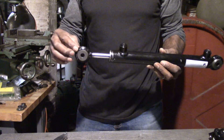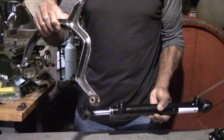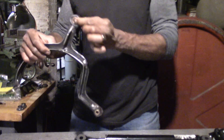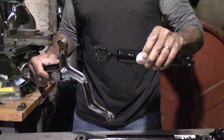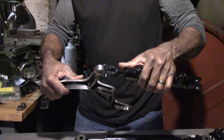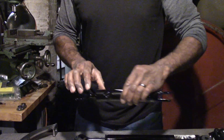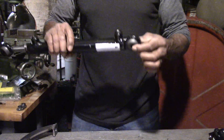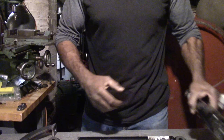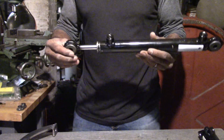The problem with this is that it has swivel ball ends, and these aren't the types of connectors or mounting points that I want, because the bracket here has a hub which the cylinder will pull on. The way I want the cylinder to connect is with a clevis — an example of that is this little cylinder here, which has a fork-shaped clevis where the hub goes inside of it and pivots quite nicely. And for the end of the cylinder, I don't want the swivel ball either. I want a cross tube like the back of this cylinder. So I couldn't find one with the two connectors that I want, so what I'm going to do is cut these off and make the connectors that I want.